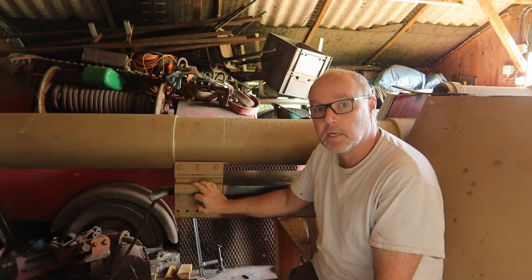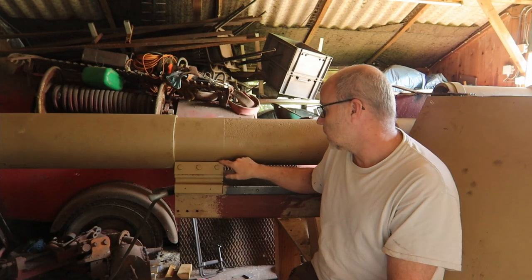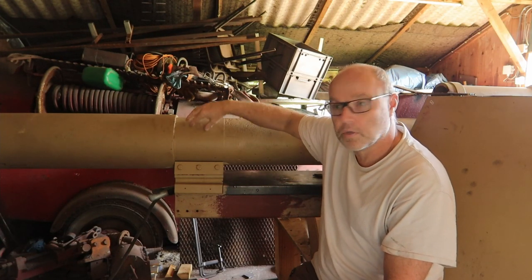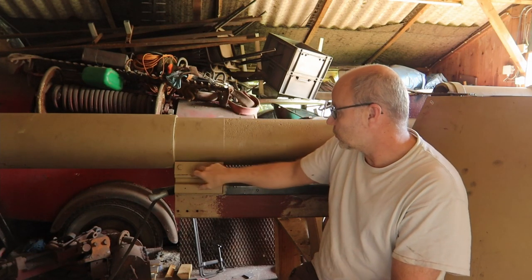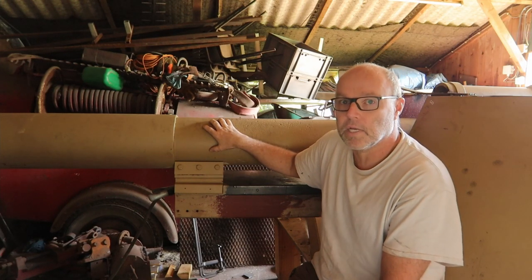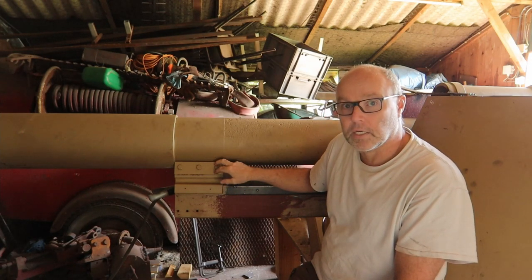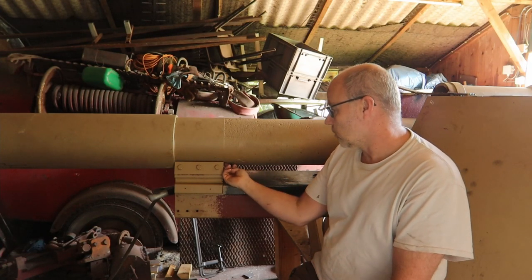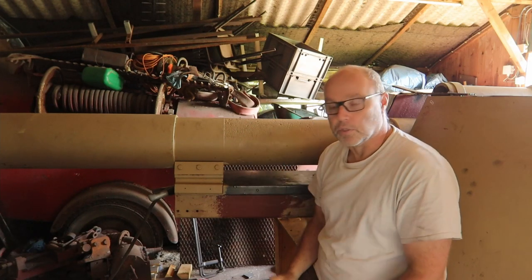You saw me make the barrel clamp. I rounded off the edges. This is a strip, and over here there's a steel band, a strong steel band wrapping around the barrel, and these three bolts will clamp it down. The strap is essentially a bit too short, and in that way, by tightening the bolts, you can really tighten down the barrel really good. And it's also sitting in a groove here so that the orientation is always good.